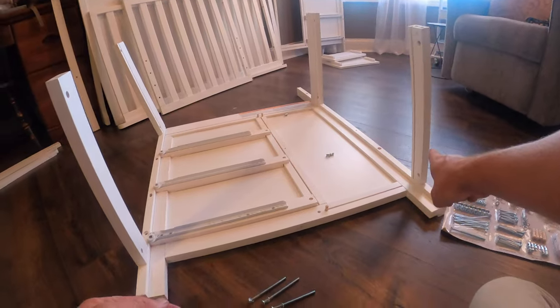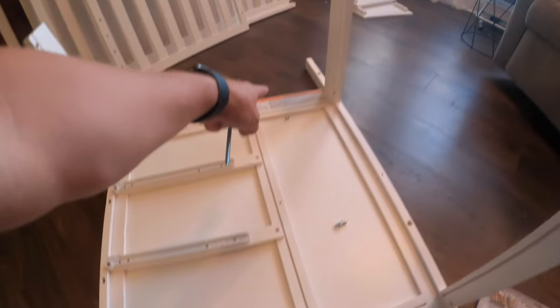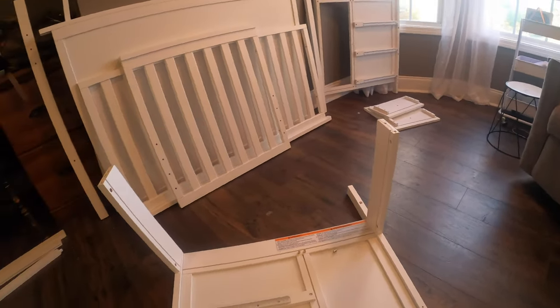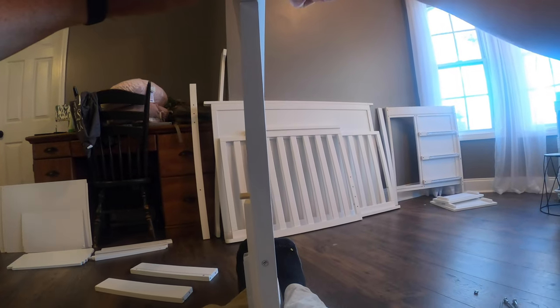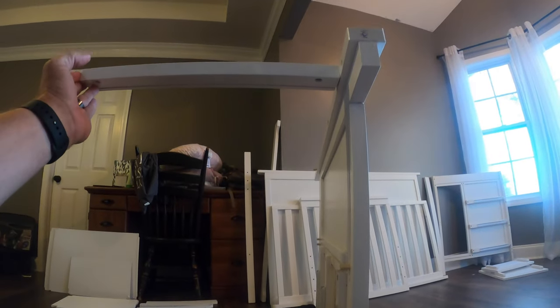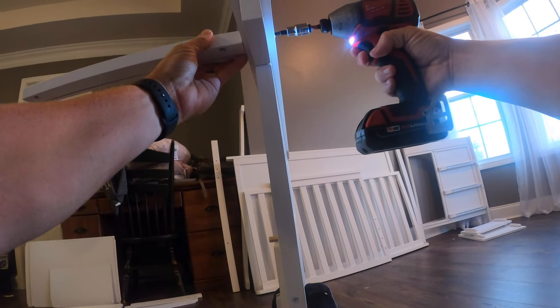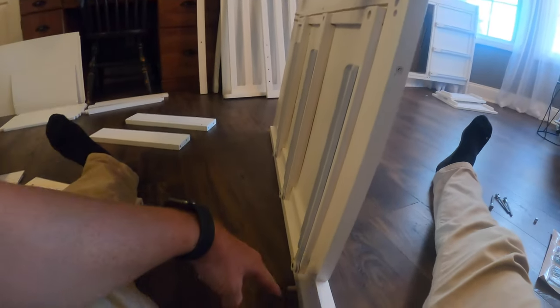So N should be here, then M, and the K pieces are the same part — but make sure they line up with the slot because a piece is going to go in there before we put the other side on. Just get it threaded by hand and don't tighten these down all the way, because we want a little ability to move things. The reason is we're going to have to put a whole other section on the other side, so we still want it to flex a little bit.